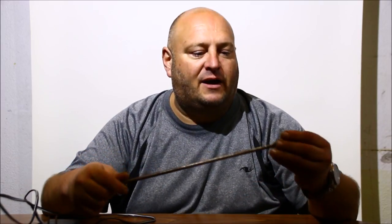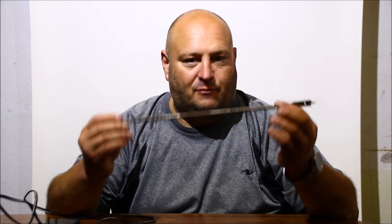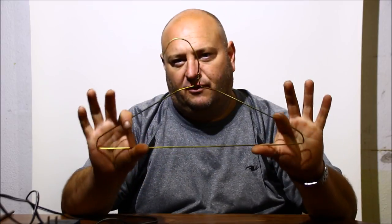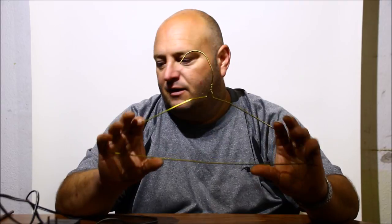You will need some sort of iron bar. Rebar is the best. I have one piece of rebar but it's painted, so I don't want to mess with it — I kind of use it for my kiln outside. So in place of that, I have an old drill bit for my saw. I will be using this rod for the positive end. You can also do this with vinegar and salt. I don't have vinegar — it got used up — so I'm going to just try it with salt. It's a good conductor when mixed with water.